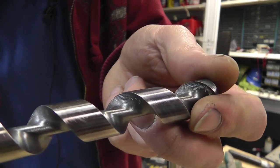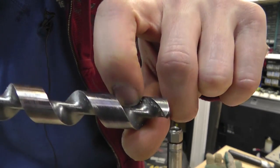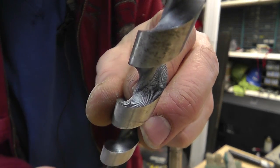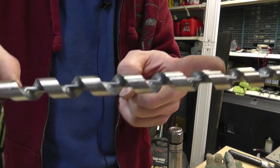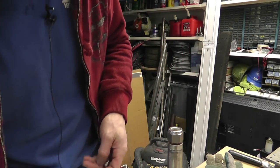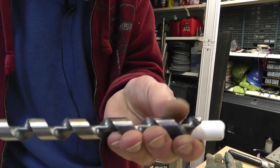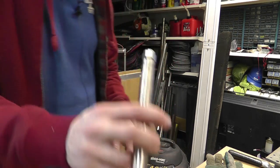The auger bit has just minuscule bits on the edge, and that edge has a little rough cut on it so it's kind of sticking in those grooves. I could get a wire wheel and brush it out. You can see where the plastic was basically powder - basically this much of the auger bit was not melted, just the tip. So all this plastic goes in unmelted. There's about that much space between the auger bit and the end.